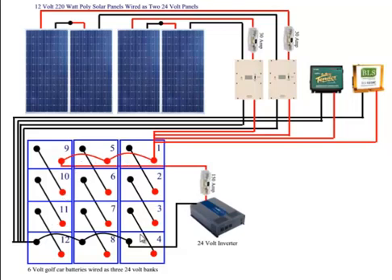This is the maximum size I can get with these controllers — I can't get any larger because these controllers max out at 500 watts. Right now I'm pushing 440 watts through these into each controller. If I wanted to add more panels, I would simply buy an additional controller and run the wiring the same way I run these.